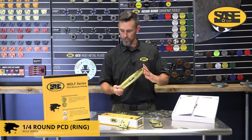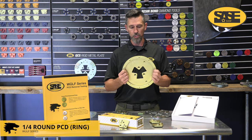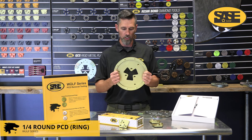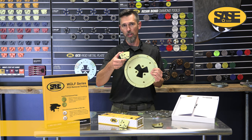This plate style is really good for uneven surfaces. For safety reasons, bolting this to the head means it'll hold up much better on rough and nasty floors. It's much safer and less likely to fly off the machine, which could happen with a QCS type adapter.